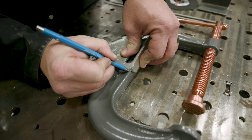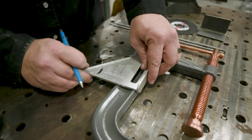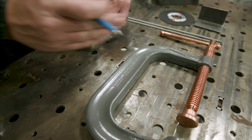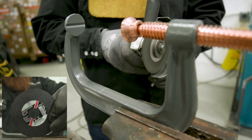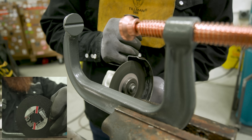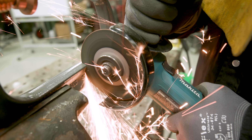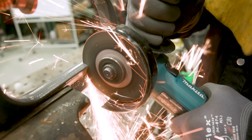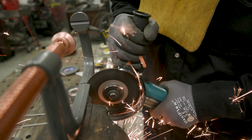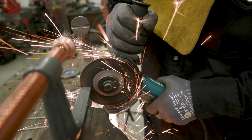So I'm going to use this square right here — we made this in a previous video, we just cut down a speed square and rounded the corners off, it still works good. I've got this set up on the vise and I'm going to use one of these cutoff wheels. You guys can use a port-a-band, saw, or even a hacksaw — whatever you have at your disposal. As I'm cutting, notice I'm not putting a whole lot of pressure on the blade. I'm letting the cutting wheel do all the work. You want to let the wheel do the work — that's what it's designed for. You'll get better results, it'll last a lot longer. Just take tiny strokes out of it.